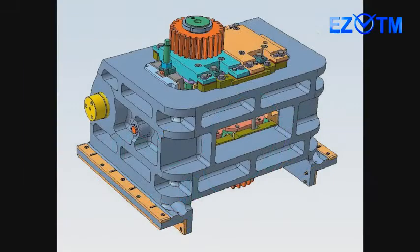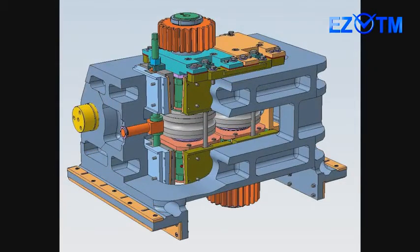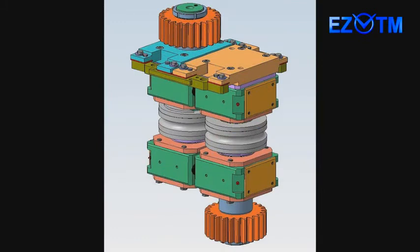The stand design allows matching optimal rolling radius of a die. It makes it possible to minimize axial rolling forces, which in turn has a favorable influence on the quality of manufactured tubes, rolling process stability, decreases wear on main drive pinions and racks, makes it possible to use dies many times with reconditioning along the outer diameter and groove regrinding.